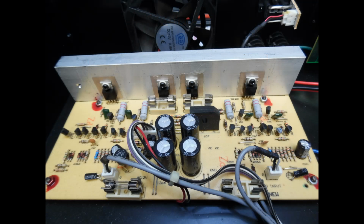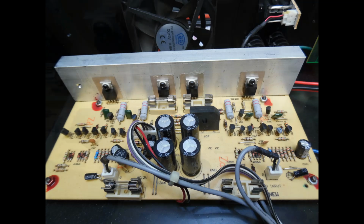So really, what was the issue with the amplifier when it came into the workshop? Well, the customer reported that they took the lid off and had a look internally, and what they quickly noticed was that there were 2 fuses blown on the right channel, which is where the power input comes in, and there's also a secondary fuse towards the back of that part of the circuit. They just clip into these fuse holders, 20mm fuse holders, and that fuse is also blown. And both of these fuses are T2 amp, or time delay, 2 amp fuses.